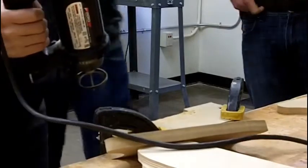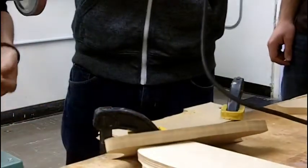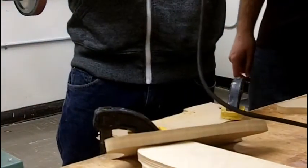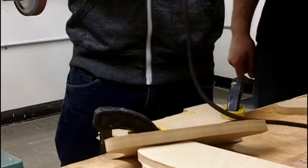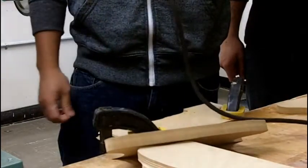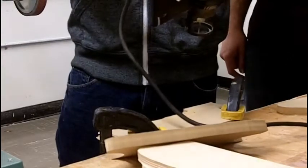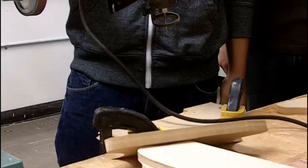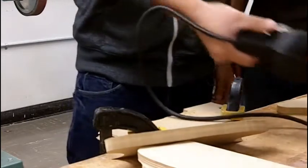Scary when you're not paying attention! I was watching how the sawdust was moving around. The way the fan works is it pushes the dust out, but it doesn't go anywhere — it actually comes out and circulates back, and that's where you get all this sawdust on the tool. It's turbulence going in a circle, pushing back in. Whenever I use this my face ends up covered with MDF — that's not cool.